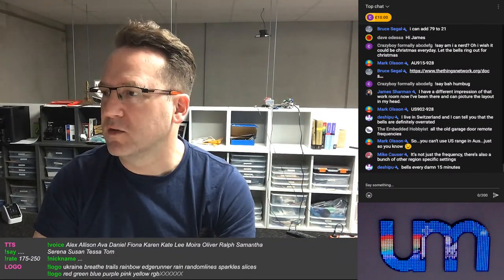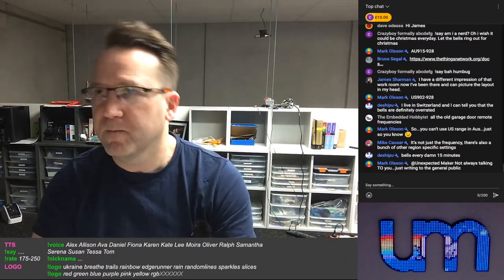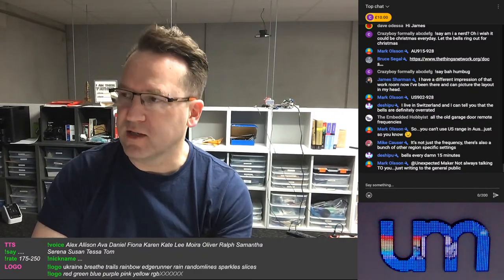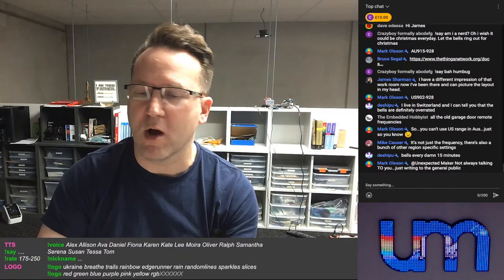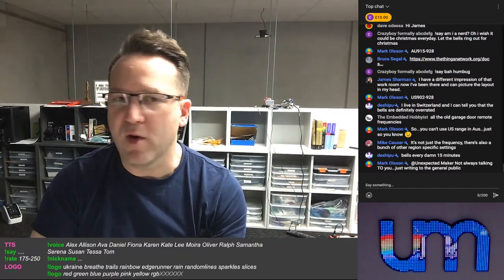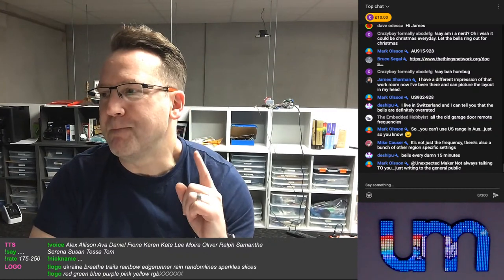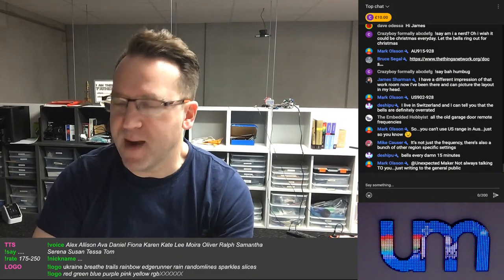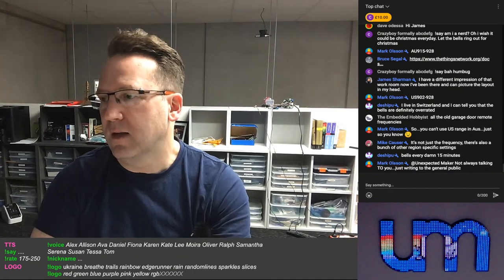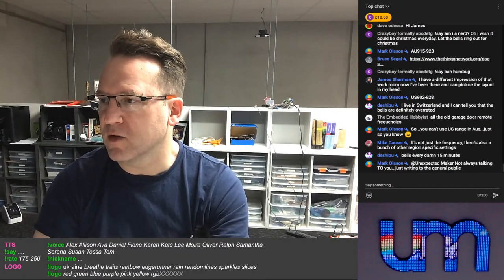I was stuck with what to do with an antenna: external antenna, onboard antenna. If it was an external antenna, what type of external antenna? And I did a poll on Twitter, and UFL definitely won over SMA. But I think SMA is better. It's more rugged, and it will last longer in terms of putting antennas on and off.